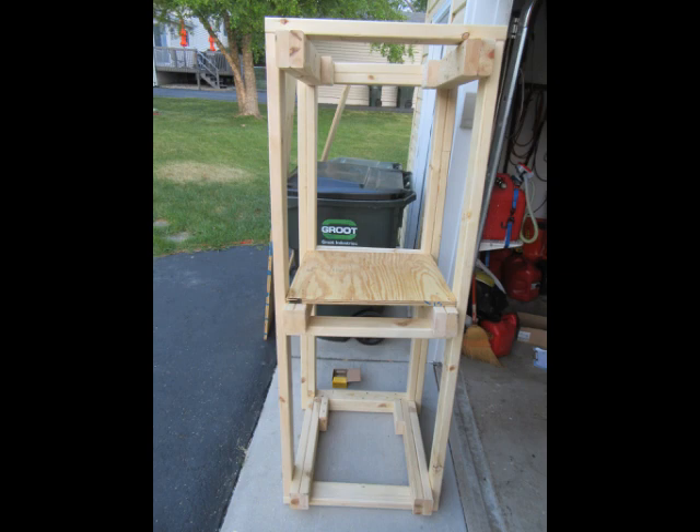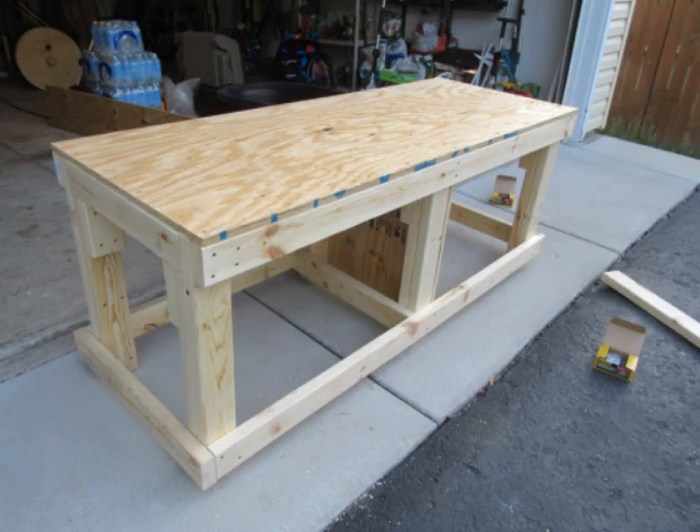It's the same result I would get by putting diagonal pieces in. I was thinking I might want to do something similar going the long way, but because I'm not sure about the plumbing yet I don't want to box it in too much — if I need stabilization in the long direction I'll add that later. I double and triple checked my squareness in three dimensions, put in the extra screws on all the legs and joists, then put the tabletop on with a lot more deck screws going into all the joists along the edges and across the middle. It's a nice, heavy, solid bench now, and I have full confidence it will hold that trough very nicely.